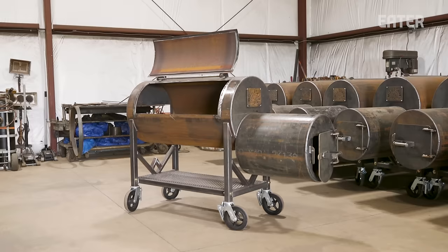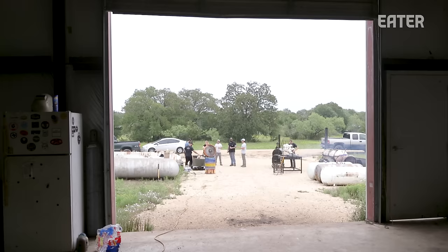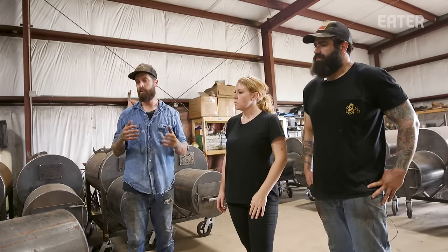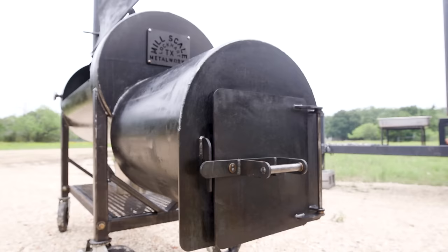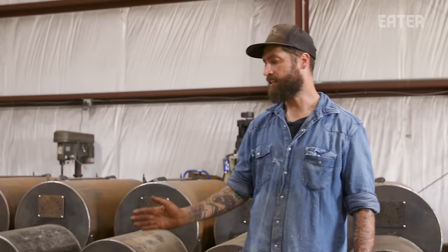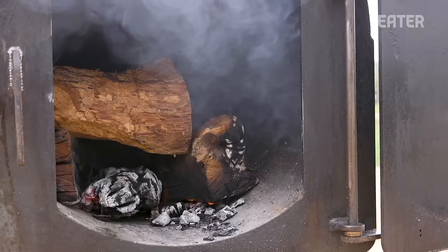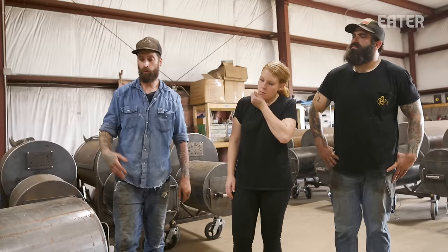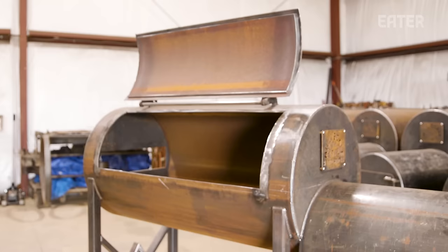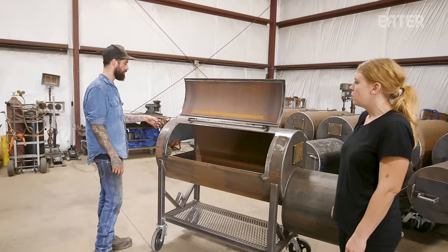When Caleb and I designed this specific unit, we were thinking about sharing meals with our family and friends and having something in the backyard. One of our issues with a lot of the barbecue pits we saw was that the firebox was too small, so we like to build an almost oversized firebox. The big reason is that we wanted a firebox that accepts full standard size logs — that way you don't have to use chunks or add one more step. Once the logs are loaded in the firebox, it transfers into the cook chamber. The smoke enters the cook chamber and comes out on a smokestack located on this side.